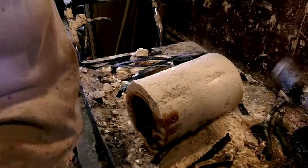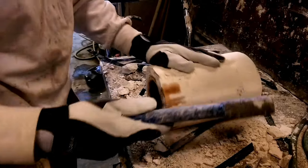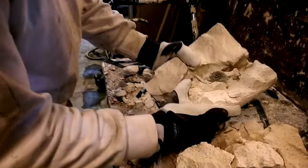When the molds have become cold again, it is time to break them open. This is done literally by breaking them open using axes, sledgehammers, and other tools to remove the ceramic or the sand from the bronze — carefully, of course, so as not to damage the surface of the bronze cast.